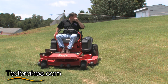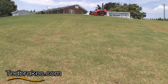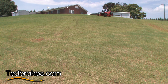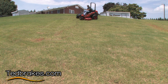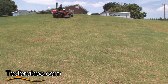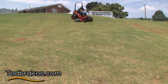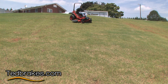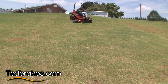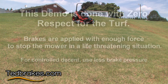We're going to show you the Kubota mower next, which has probably the most safety features of any mower built. I'm going to take off the park brake, pull the handles in. On this particular mower, if you were mowing on the side of a hill and your pump belt broke or something, you can simply stop it because you have all four-wheel brakes. If I'm on this hill with water at the bottom and the motor cuts off and I start losing control, I've got an easy, convenient rear brake — which should be on all mowers — and also with the TED brake system, if you were sliding you've got all four brakes. We're going to do this at some speed and show you how effective the four-brake system is.